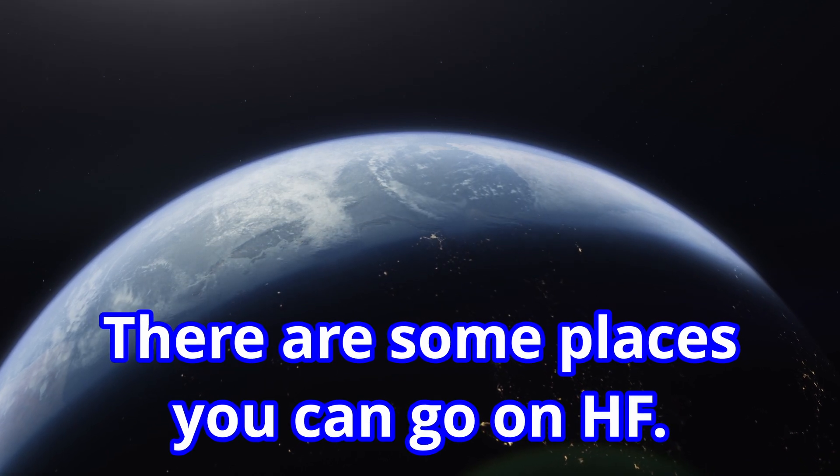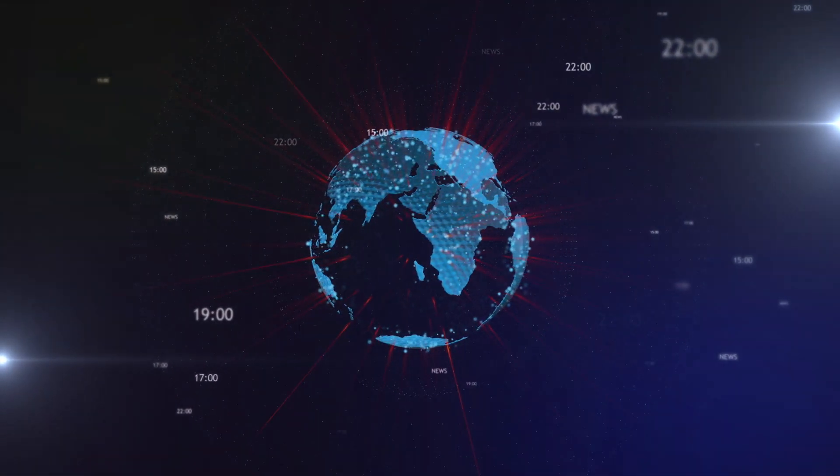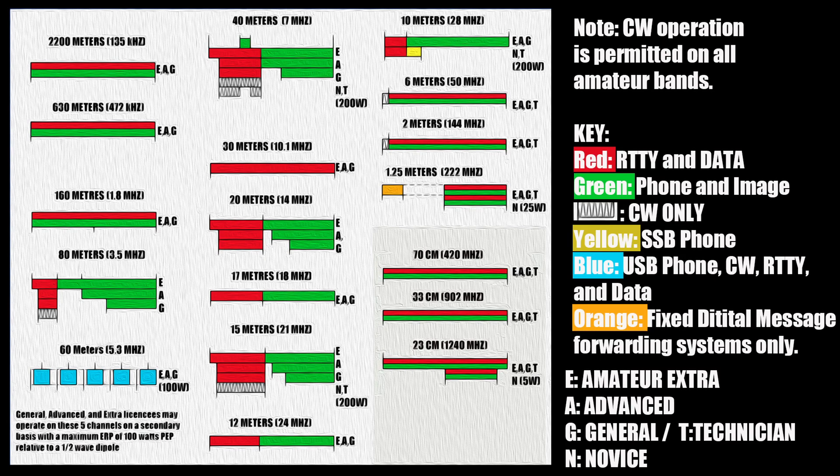The biggest disadvantage to the Technician license is you're pretty limited to VHF and UHF. Those are higher frequencies and they don't skip across the atmosphere, so you're limited to local communication only. The General license is a bit better — also 35 questions — and it'll get you on HF where you can talk around most of the world. Some people stay at the General level for their whole ham career, but you do have to be careful not to venture over the band edges into the Extra portion. You can easily see this using the band plan chart from the ARRL, which shows all license limitations for all three tiers, including older tiers like Advanced and Novice that have been done away with but are grandfathered in and still in use today.